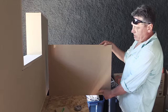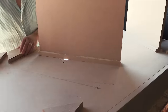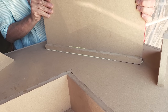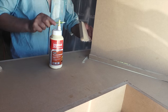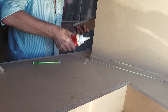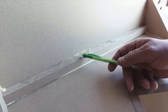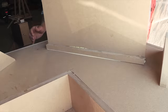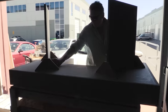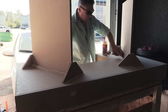Next up is the legs. One nice thing about building your own custom desk is that you can have the height perfect for yourself. We went with a 29-inch height from the top of the glass to the floor for our isosceles triangle reinforced legs. The assembly is a little tricky — you put the leg components together, and when the glue is grabbing but not yet hard, you wipe off the excess. We then position the legs at an angle for a bit of extra strength; they're supported at the top by trapezoid shapes.